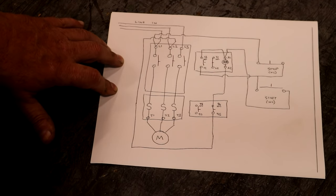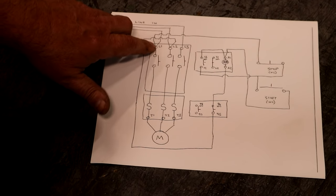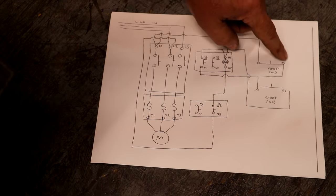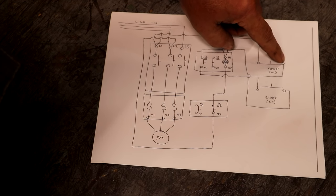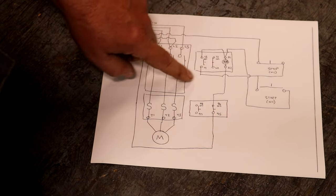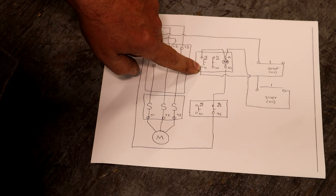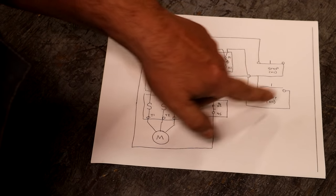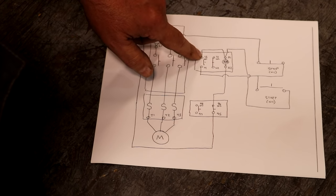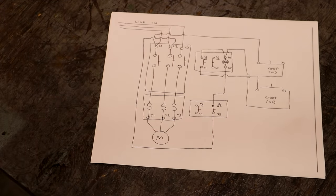So this is your wiring diagram summary. Line voltage comes off L1, over to one terminal on the stop switch. Off the other side of the stop switch, one wire goes to one side of the start button and another wire goes to the auxiliary contact block going into the coil. Off the other side of the start button, one wire goes to the coil. We have a jumper between the coil and the auxiliary line. L2 comes through the overload protection to the other side of the coil. It's very straightforward — only three wires to wire up that start-stop button.